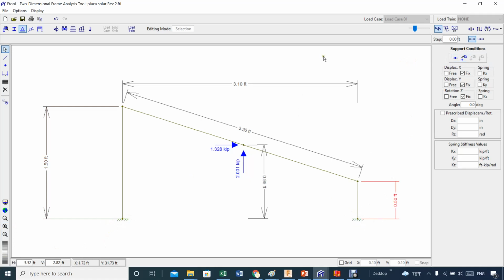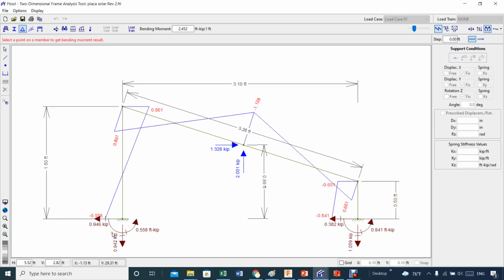Now, if I do this the way it should be, for example, let's check the moment. You see, this is a big deal. We have a problem in Houston. We have a lot of bending moment right at the anchor points. No good. This is so huge that we'll pull this bolt out of the socket here. So that's a problem. We cannot allow that to happen, and therefore this is not a good design, at least for my case, for what I'm looking.